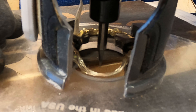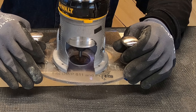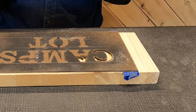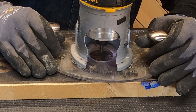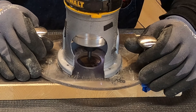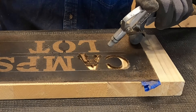I'm setting my depth just slightly beyond the bottom surface of the hardboard. Now this hardboard is pretty tough on bits, but I decided to use the carving liner because I wanted to have really tight lines to the edges of these inside lines. The hardboard is really tough but these solid carbide cutters should have no problem getting through them — my bit is fairly sharp.